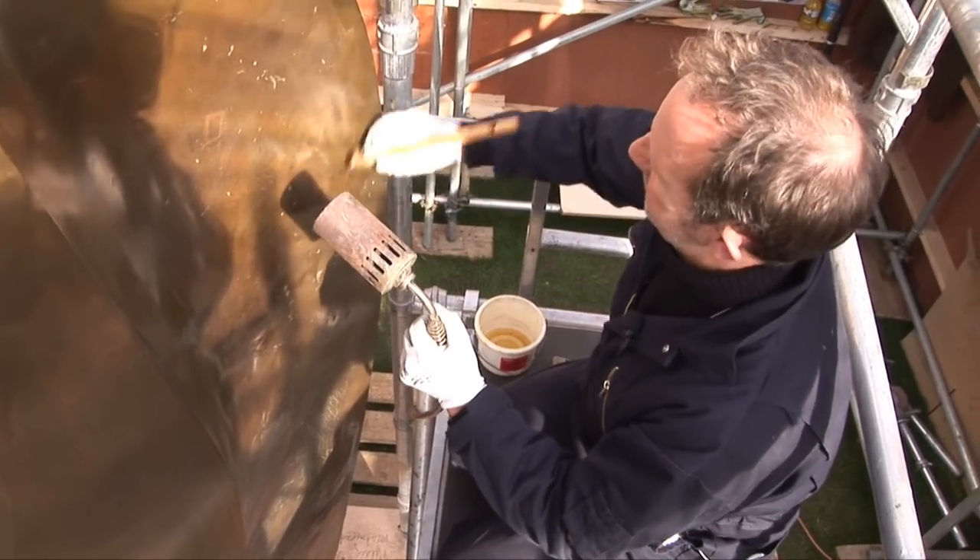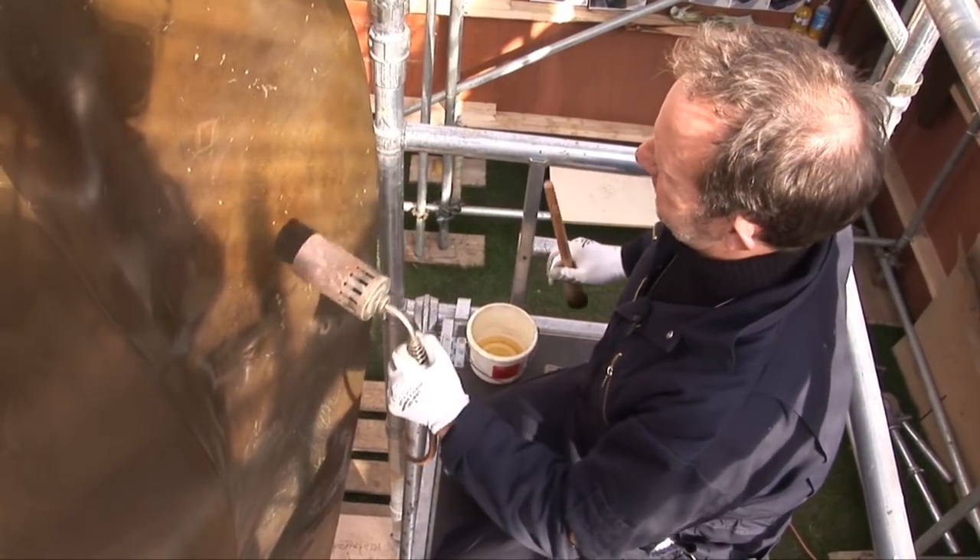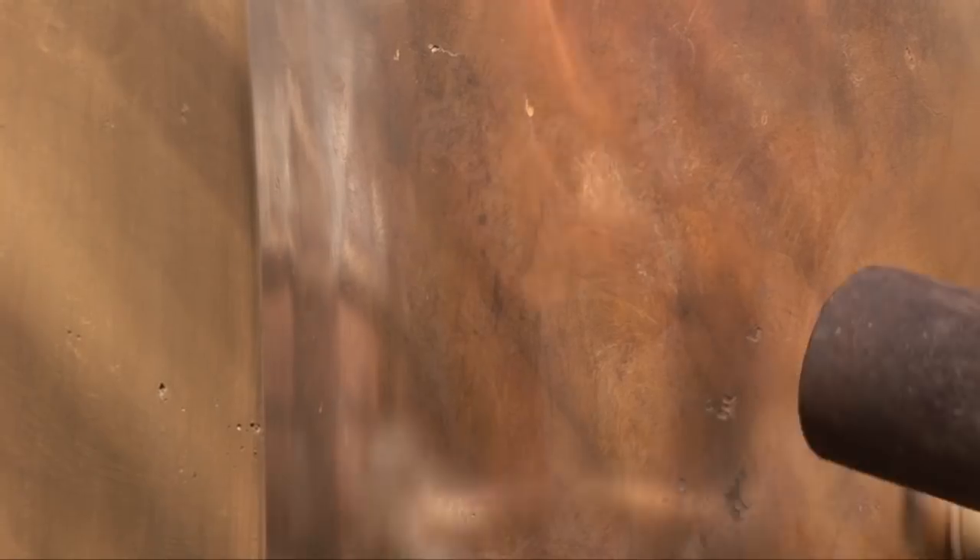In the case of Moore sculptures they have a very pale patina with some darker areas, and that is done usually using heat and cold patina applications. The time it takes is very difficult to judge and that's why we had to allow in this project an adequate time to create this surface.